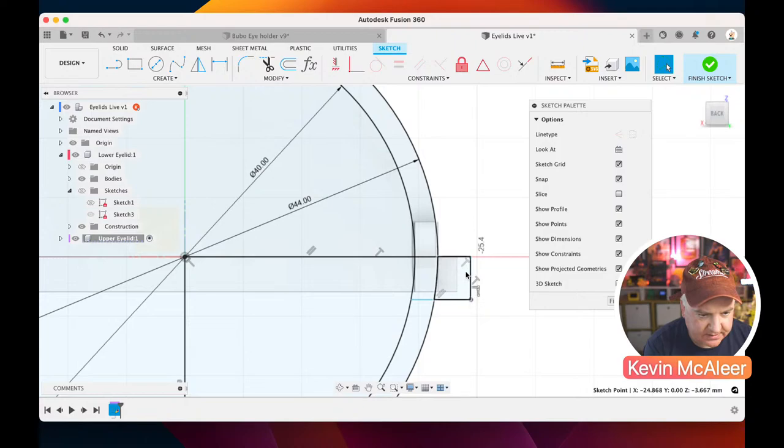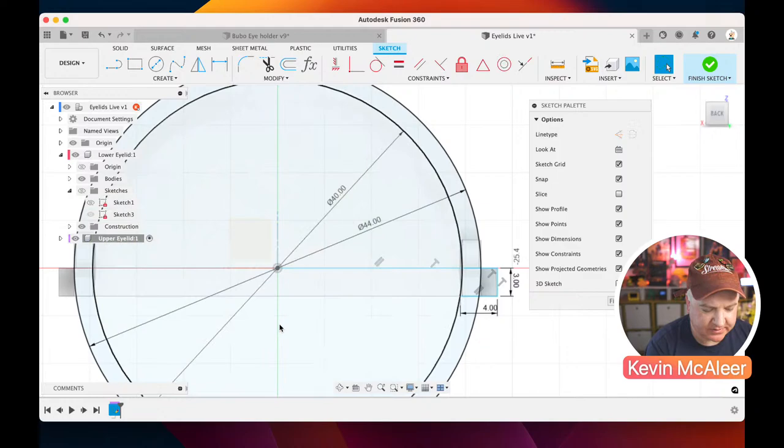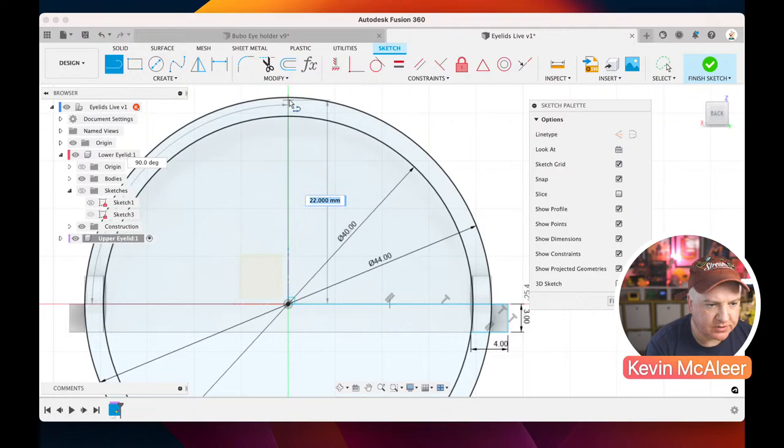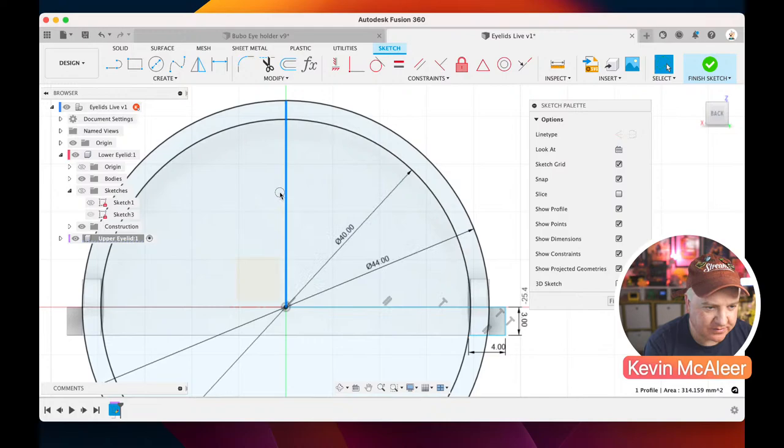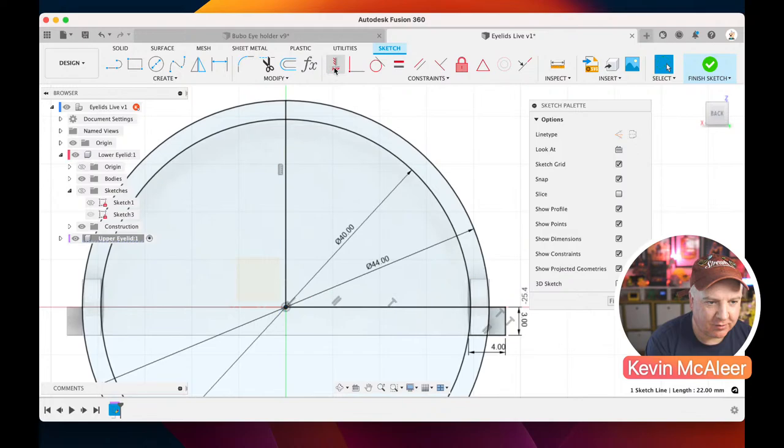What we need is that side one there needs to be 3 millimeters, and that bottom piece there needs to be 4 millimeters. Nice and simple. And then what we can do, I'm actually going to get rid of that one. It's the exact same that we've just created, and we're just going to rotate it minus 180 degrees. So we could actually have used the other one to begin with. See how those two have got a perpendicular constraint, so that they're always 90 degrees, but I just need one of them to be either horizontal or vertical. There we go, like that.